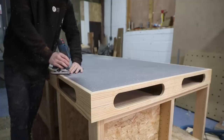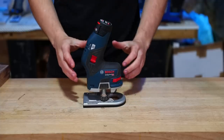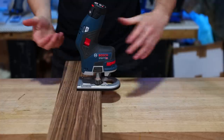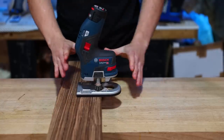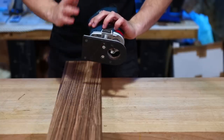It's made for putting roundovers and chamfers on edges, and being able to do it on the fly — whether going vertical, working on a flat surface, or going from one end of the workshop to the other without worrying about trailing cables. This is an easily portable chamfering and roundover tool. The weird shape is optimized for edge profiling — if you pop it on the edge of a piece of wood, you can see it plants itself there very securely. The handle shape lets you put more pressure there, and you've got two gripping points which make it a perfect area for your fingers.